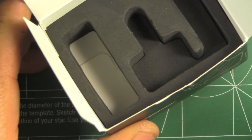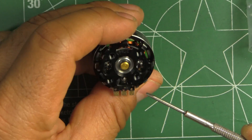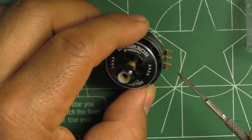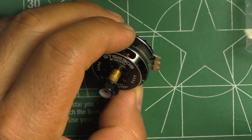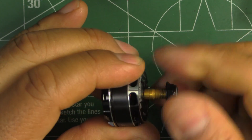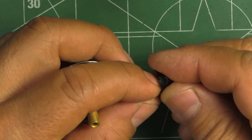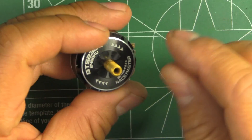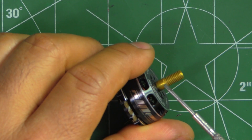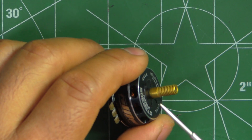This one is slightly different than the other motors. As you can see, this one comes with a PCB so it doesn't have motor leads — you would solder your motor leads there. And of course they give you the prop nut. It's a nice low-profile nut with a wide flange. The motor shaft is made out of this golden steel alloy.